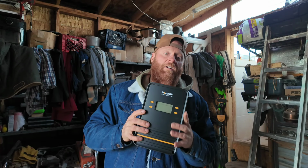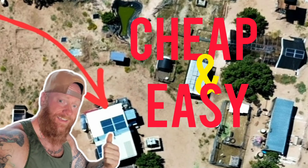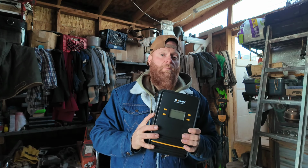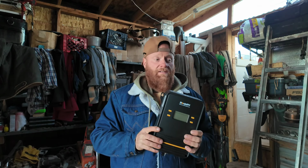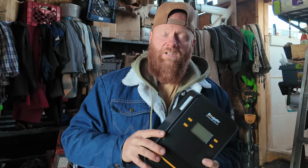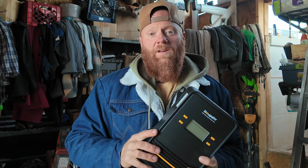You also don't need the 100 amp charge controller. This system I'm showing you here is what I would do personally if I was going to start from scratch and I wanted a nice system that is very expandable, that's still pretty easy and relatively affordable. But you could definitely go much smaller on the charge controller just to get started. However, the real benefit is that because this is a 12-volt system, you need the largest charge controller possible if you're going to put in 1,000, 2,000 watts down the road. And once you get to 2,000 watts, if this can't handle that in 12-volt anymore, well, switch that system over to a 48-volt system. When you're ready to upgrade, this system could take maybe 3 times as many watts coming into the system.